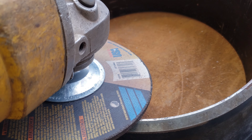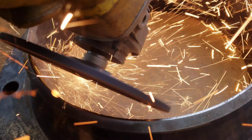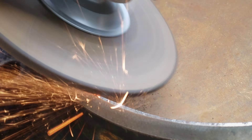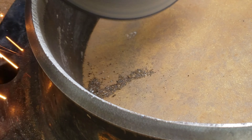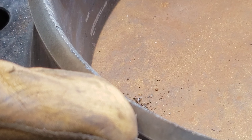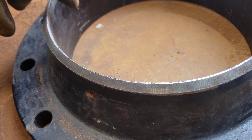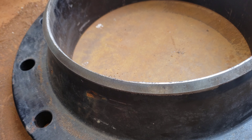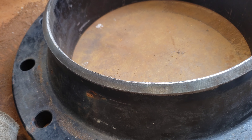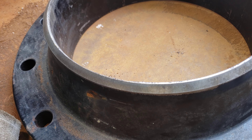I'm just going to do a little bit and then we'll skip ahead. See how I took the landing off — that's a good gauge. Cutting this off, you know exactly how much you're taking off. I'm going to do that the rest of the way around, and then I'm going to take a sanding disc, get this corner broken off, smooth and transitioned. Take it down, put your sanding pad on, and blend it in.